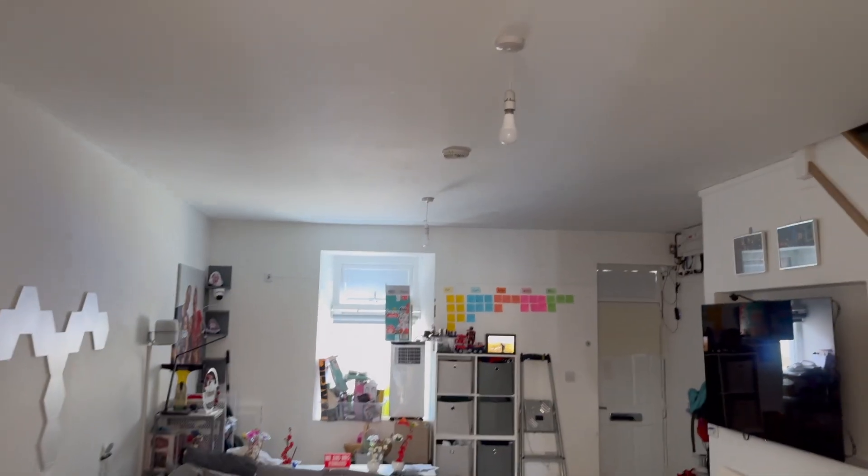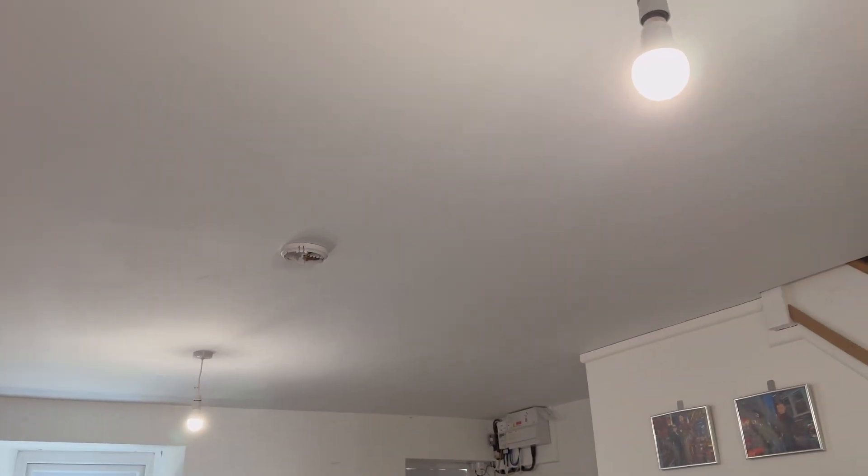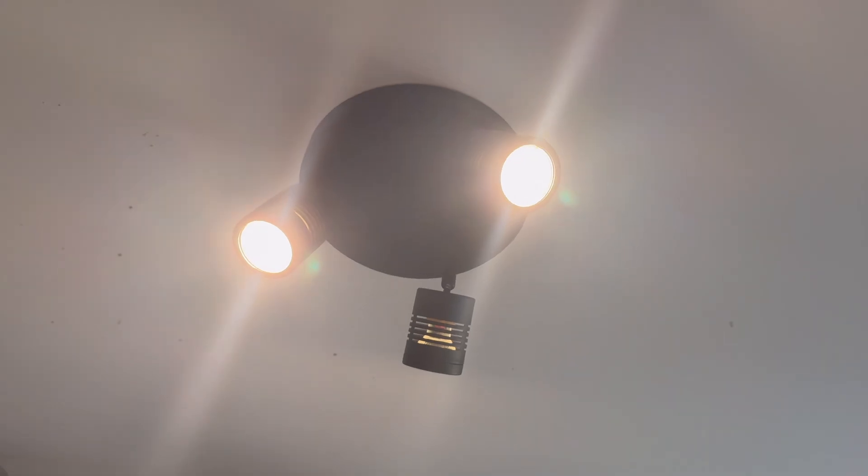I made sure the antennas were nowhere near each other and left one bulb in my lounge using the old ZHA integration and the old dongle, and moved another bulb over to Zigbee2MQTT on the SMLite dongle. In this clip I did catch it being slightly quicker on the new integration, but on other occasions I saw it the other way around. So much of a muchness in terms of speed performance, but the reliability has definitely been even better. The amount of times I'd walk into a room and the lights take an extra second, or my cupboard door — using an Aqara ZigBee sensor to turn on an IKEA ZigBee bulb — would sometimes be delayed, as if something was waking up for the first time. But now every time I open that door the light comes straight on.